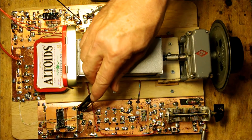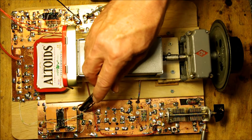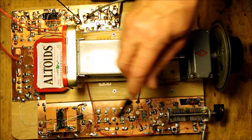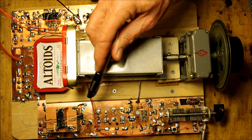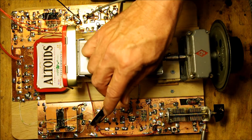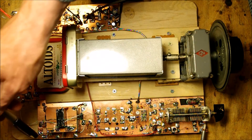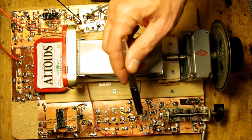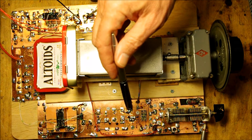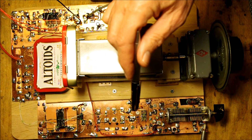Under here is the CM455 crystal mechanical filter from Toyo. We don't have a lot of information on it, but I estimated it's got about a 1000 ohm input impedance, so I built a little L-network to match the 50 ohms here to 1000 ohms here. There's another L-network on the other side. This relay is so that I could eventually switch in a much broader filter, because I'd like to be able to listen to AM.